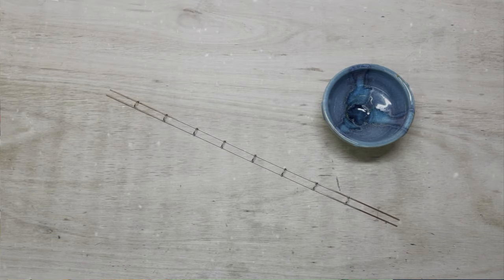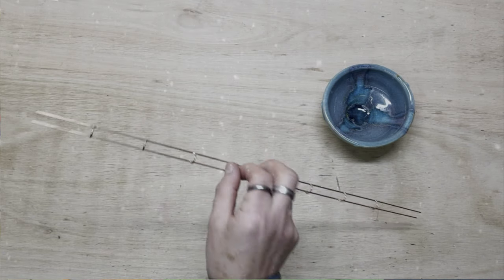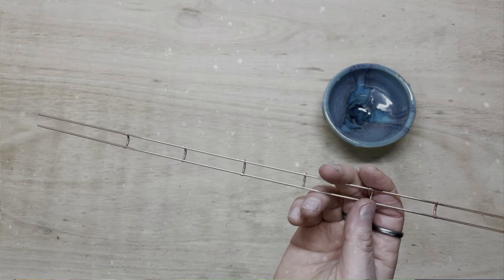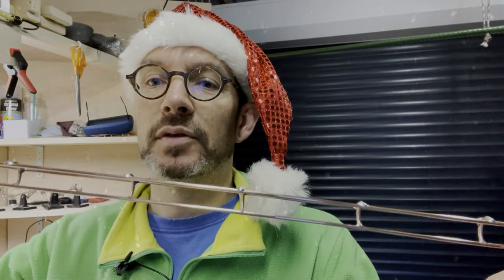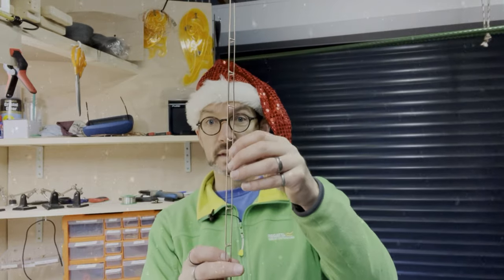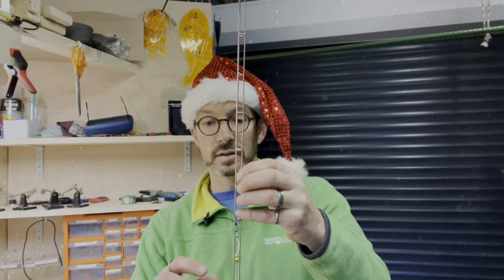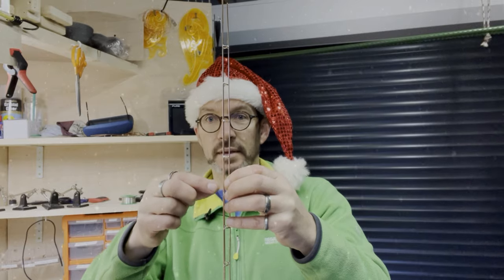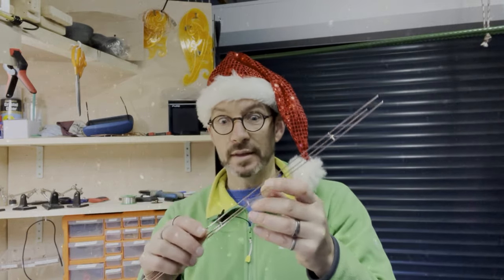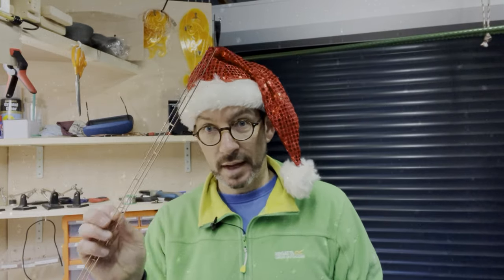With the helical lift, the balls need a vertical track to run up, so I made that first. Now they do flex a little bit, and that's not suitable for the vertical track, so even though it's not the prettiest thing, I have added a third track onto the vertical track, which keeps it very stiff in this direction. That means if I can set this dead vertically into the sculpture, then the balls will run up this, and they won't be going in and out due to the vertical track. So that was the first job, and I've got that done, happy with that.